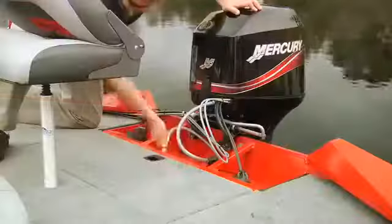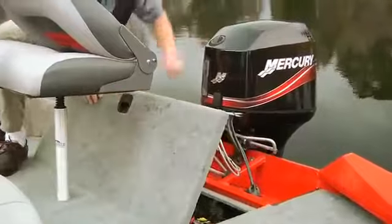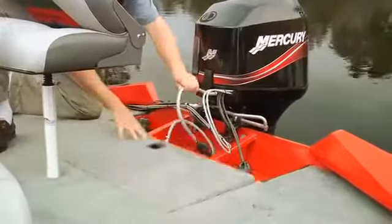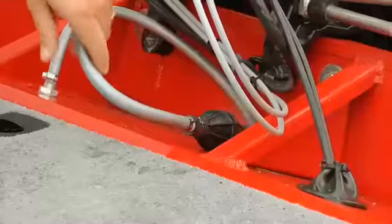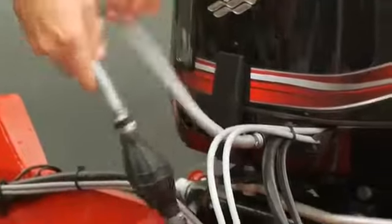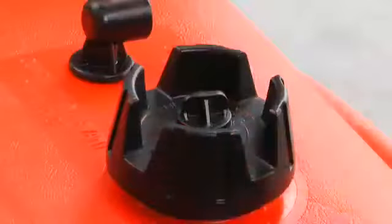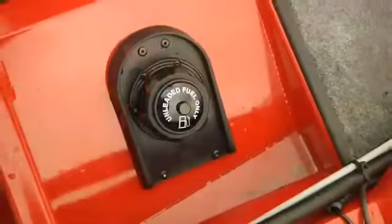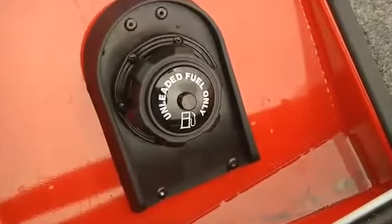There should be no trace of leaks or scent of gas — sniff the bilge to make sure. Gasoline is highly flammable and explosive in a confined area. All outboards will have a primer bulb connected to the fuel line. Squeeze the bulb until it becomes firm, which means the fuel has reached the fuel pump on the engine and will make starting easier and faster. If you're using a portable fuel tank, be sure the vent on the top of the cap is open. If it's a built-in tank, it's always vented.